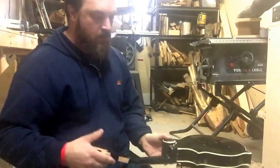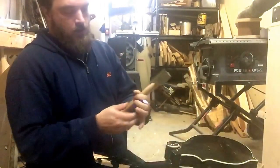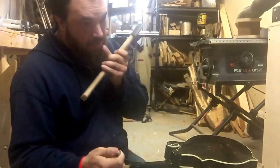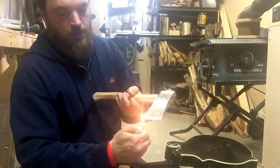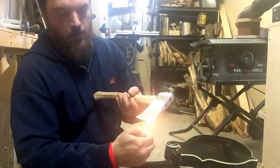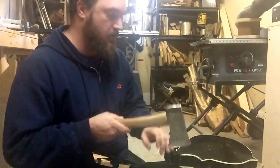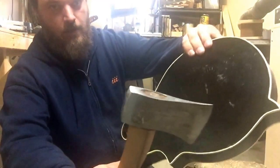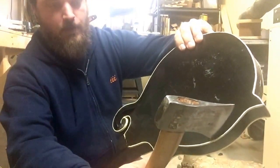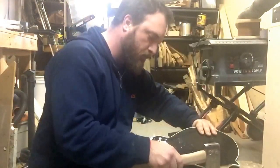Sometimes heat helps, so I'll demonstrate that. If you heat your blade, that'll help loosen up the glue. So just get it warm, and that ought to help the blade really relax the glue so that it'll come out. So you just want to, real careful, get your blade right in that binding spot there, and start to take it out, kind of like this.